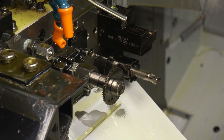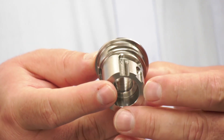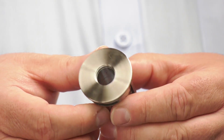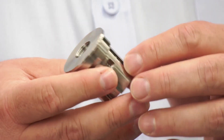The 3.1mm holes are for key chambers, and then we've got three drilled and tapped holes on the job as well. On top of all of that, there's a tiny four millimeter keyway down the inside of the job, which required a special cutter ground specifically to do it.